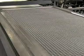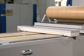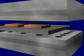The VarioPIN support system identifies the loading of the charging tray by means of an optoelectronic device. The square pins are activated based on the light-dark principle, creating the two levels required for the pressing process. The integrated PLC also permits job-specific part optimisation.